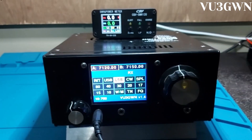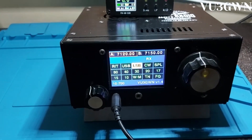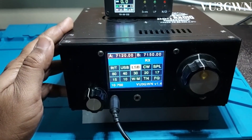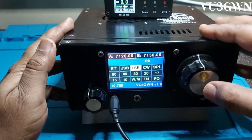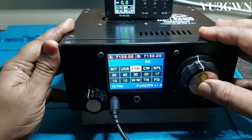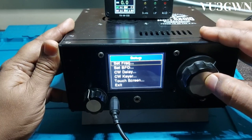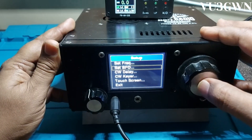I'll stop the transmission on my 7300, then press and hold the tuner knob for about five seconds. It'll go into the settings screen. Once there, you don't need to adjust the frequency — you need to adjust the BFO, the beat frequency oscillator, for zero beat.